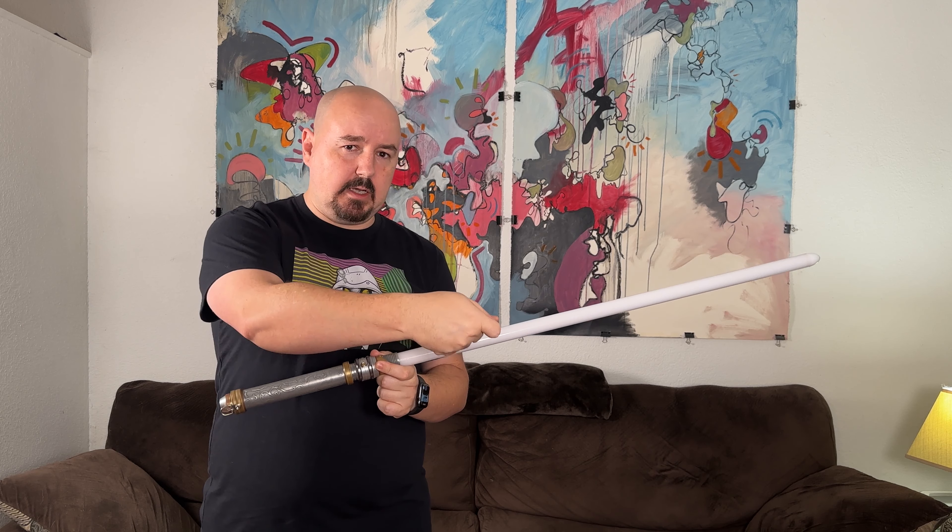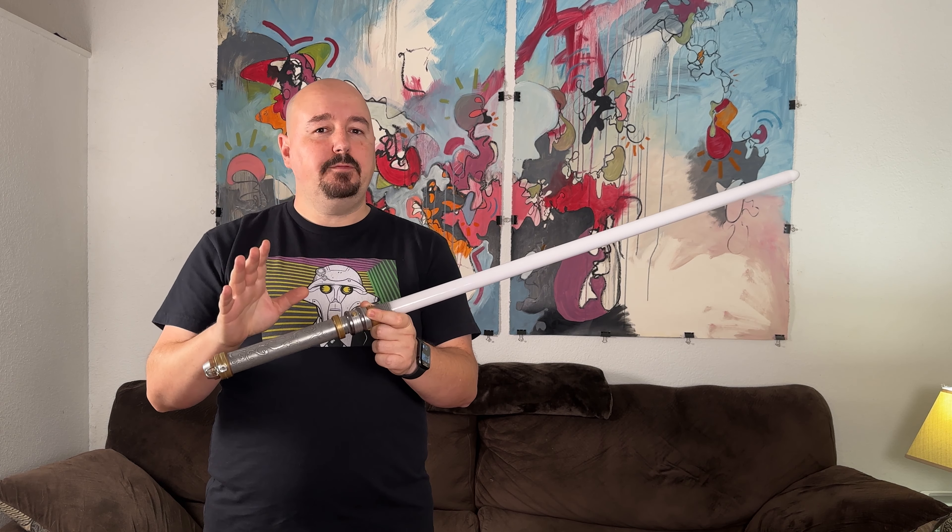When the hilt is facing you, left is your power, right is aux. Hold aux, tap power, and we have the Hu Yang voice pack from Brian Connor that I've provided for edit mode. You'll really only get that if you're doing that, or the volume level if you decide to jump into edit mode — that's on the printout. Hu Yang will guide you along. So that's the battery level preset. If we hit aux we'll move forward; if we point the hilt down and hit aux we'll go backwards. Let's go to the top. Now we're on Starfall. To start the saber we can either hit power or use a gesture control — I've included twist on and thrust on. Those will get you into battle mode, but if you don't like battle mode you can just hit power. Now we're in regular mode, and all that means is that clashes are just clashes. If you want to engage a lockup, you have to hold either aux or power as you clash.